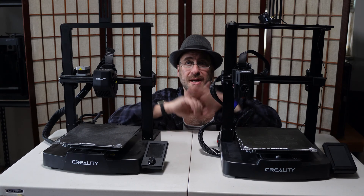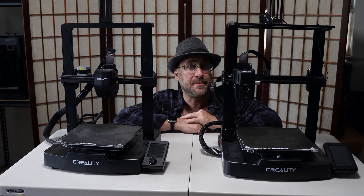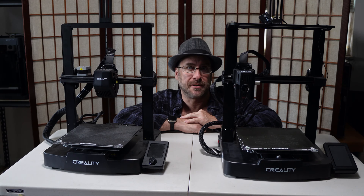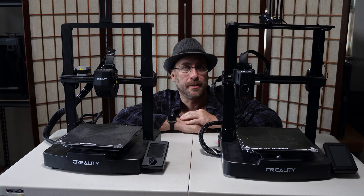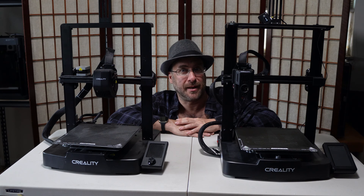Fast forward a few years with the arrival of the Version 3s — they are mysteriously missing tensioner knobs. This is an interesting choice that I don't agree with. Perhaps this is because the new generation of 3D printers require a lot less manual configuration, or perhaps it's a conscious visual design feature to portray a more advanced, easier-to-use modern 3D printer. That said, belt tension is something you should be aware of, and adjusting that belt tension is something you should understand how to do.